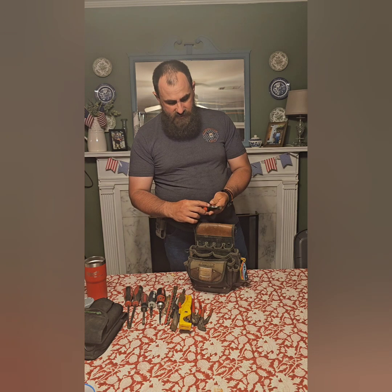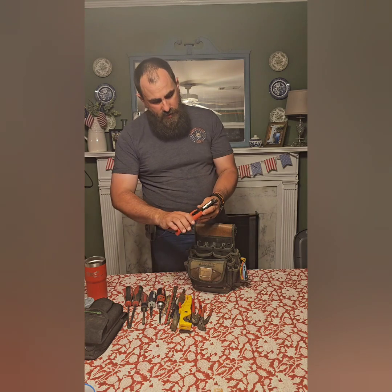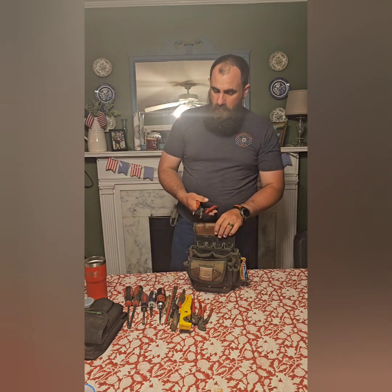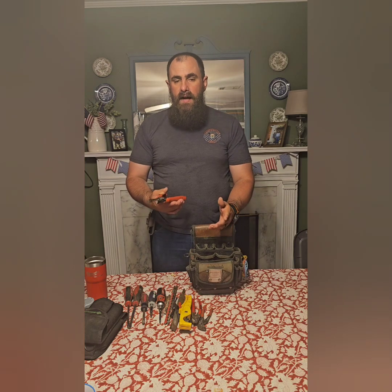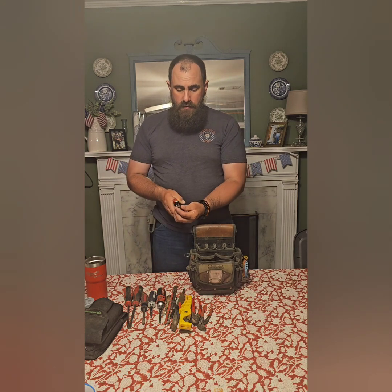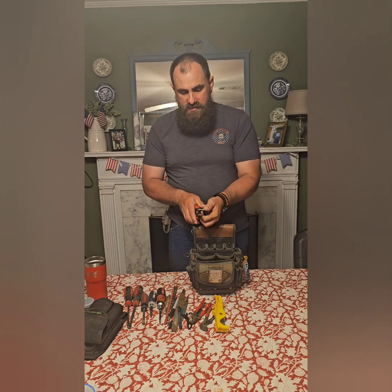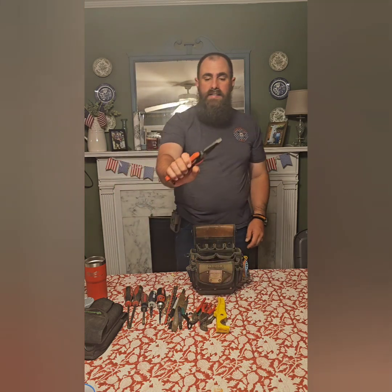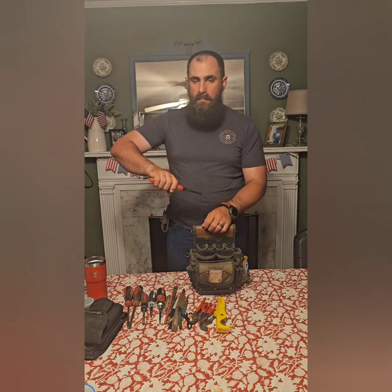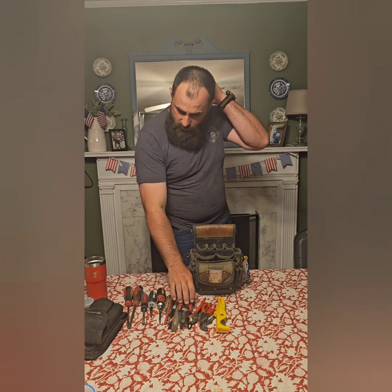I don't have to cut off studs or anything like that, but it's got the 8-32 and the 6-32 bolt cutters on there. It's got a crimp on the back, and these wire cutters right here are awesome — they are sharp and they do an excellent job of cutting through just your standard 3, 5, 7, 9-pair wire. And then these wide tips on here are a little wider even than these Knipex 160s. Not quite as wide as a good pair of linesman pliers, but they are perfect for grabbing onto and really cranking down on that wire. Excellent pair of wire strippers right there.